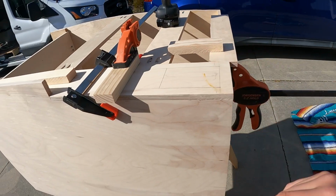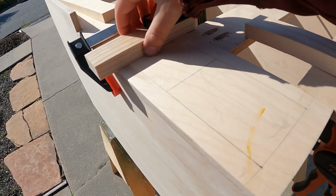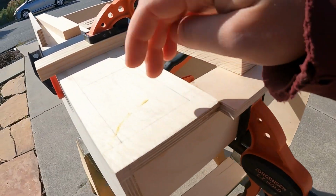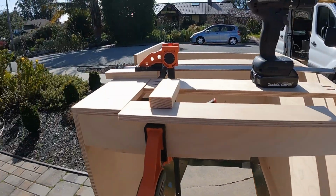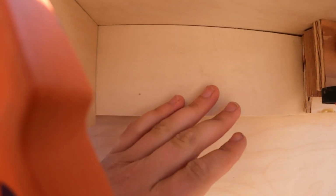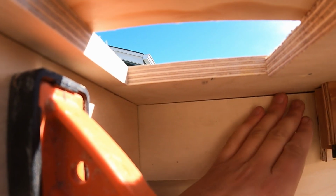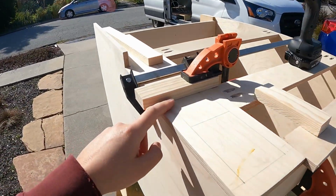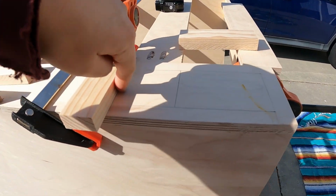And I have a series of clamps. Basically, I'm gonna drill a hole right here and then use these. I have a flush router bit. So once I drill a hole, I can drop that down in. And then basically my guide I set up is right up in here, so it's going to run along this line and give me a nice smooth straight line. And then this one here is my bottom guide, so the edge of the router will hit that.